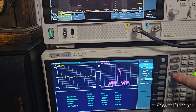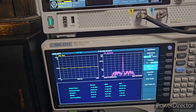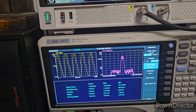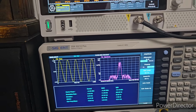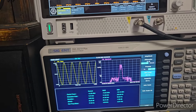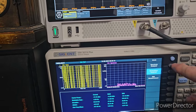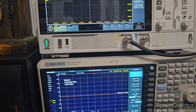So this is exactly the same as on the video that I showed. It's about 3.95 kilohertz on FM. If I go any more, it just shuts it off. So you can't get any more than 3.95K, which is good. You're going to sound good on FM. I don't know what your guys' standard is there for your FM band, your 40 channel band, but I'm assuming it's only like 2K or something. So this probably will be very loud to those that aren't running something that can do that, like a guy on a normal, legal CB, I guess is the word. So it should sound good to them, but probably a little louder than what they would like. But you can always turn the mic gain down, and that'll alleviate some of that stuff.